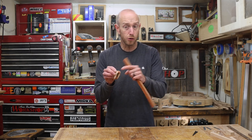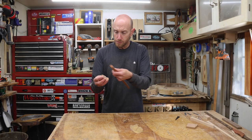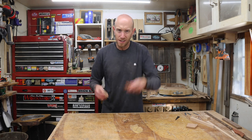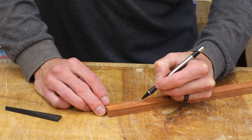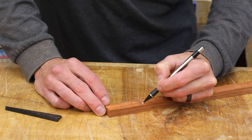Now all we're missing is a wedge to hold the iron in place. I'm going to use a piece of the same padauk that I used for the middle spacers — mainly because it's already the right width — but you could use any scrap of wood, and you can even have fun with it: laminate some pieces together, make some colorful combinations. The angle I'm going to use for the wedge is somewhere around that 10-degree mark — try to shoot for something around 10 degrees. Here I'm just sketching in a little rounded portion at the top of the wedge, which helps you grip it for removal and also gives you a surface to tap with a hammer for fine adjustments.